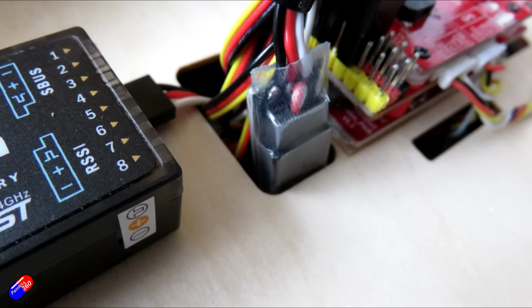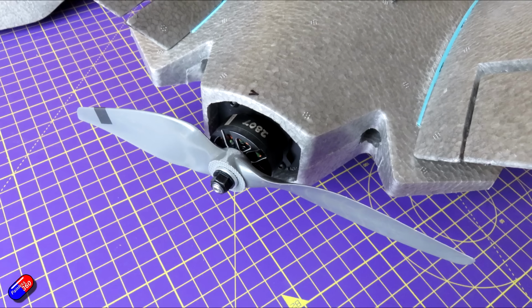The only other couple of things I've done, I have added this little connector here. This is actually a Menace RC switch that's designed to turn the LED light on and off under the vehicle. Sadly, it only controls the white one under the vehicle rather than the ones on the wingtips. Those wingtip ones are powered by the same power rails that power the servos, so you can't really change them. And lastly, I did balance the prop. It isn't absolutely perfect, and it is a bigger prop spinning more slowly, so we'll see how the jello works in the camera. Fingers crossed it's not too bad.